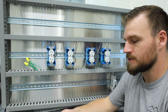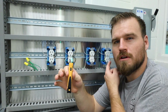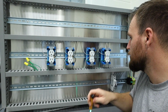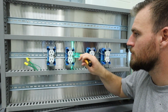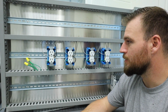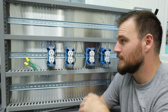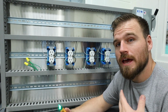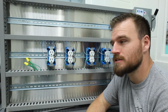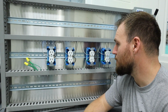When we submit this, what I'd like you to do is take your pen and just walk through each terminal, showing me that there's power in each one of these plugs. You can also do this with a multimeter if you don't have access to this or it's being used, okay? So just go down each one and show me that it's got power all the way across. Now, ultimately, all you really are doing is linking up the hots and the neutrals and the grounds. This is really a pretty basic circuit. It's got a lot of wires and a lot happening. So it's okay if you need to pull the actual components off the board to attach all the wires. It's going to take a little bit more finesse to put this guy together. Otherwise, it's not a bad lab at all.